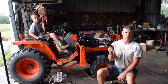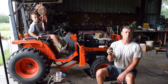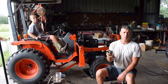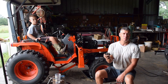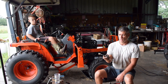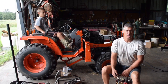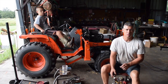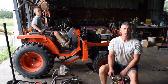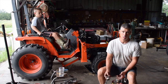The shutdown solenoid was getting really hot, and it was starting to lose its hold, keeping it in fuel position, and it was starting to go to no fuel during cranking, giving me a really bad time not starting. So this motor would crank and crank and crank, and it would almost hit. It sounds like it's just about to start, but it would never hit, and blowing a lot of black smoke, which usually means combustion and it's working.